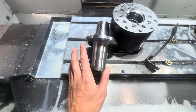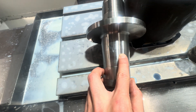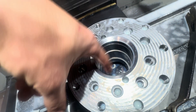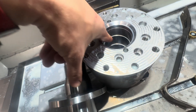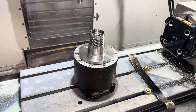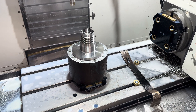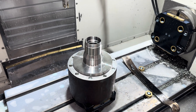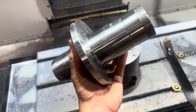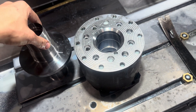I've done a load of cycles to get this control bore right and it's all good. I put this in — I could barely get it out — so that's ideal. You can see a slight trace mark around there: that's this line here, so I do need to take this other bore out quite a lot more so it's not hurting this, but this isn't interfering. And then c'est fini — it's done. No panic — it's just a turning job. Really good fit. Cleared the bits, sits flat on there. That is perfect.